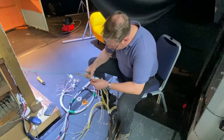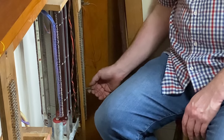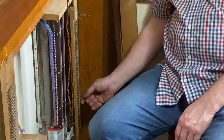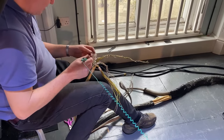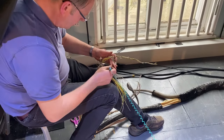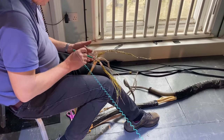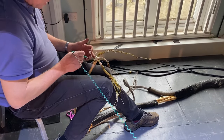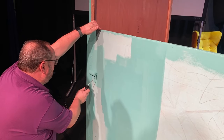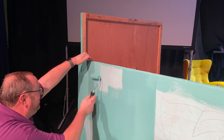What you're seeing here is the process by which the console is connected to the relay system. Cameron is sat in the relay room with a testing wire and will place it onto the tag board. Downstairs by the console, Damon is ready with an electrician's screwdriver which will light up when he finds the correct wire. He can then label that wire, and we know the cable is in order, so we can connect it to the keying on the console. Meanwhile, Colin and Michael were painting the new box that would cover the console to protect it. Even Sean was excited.